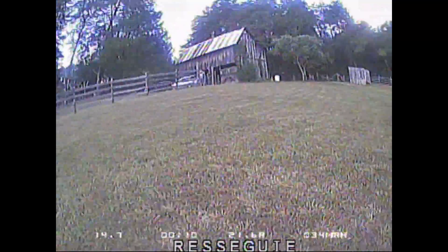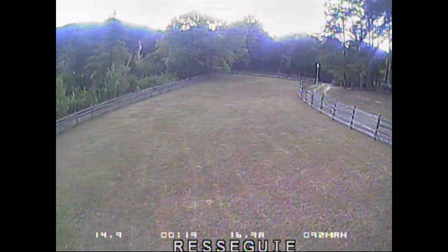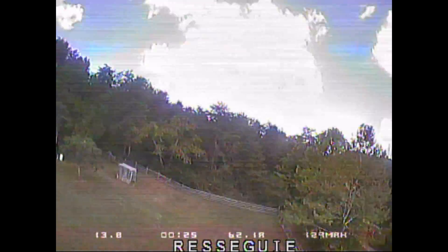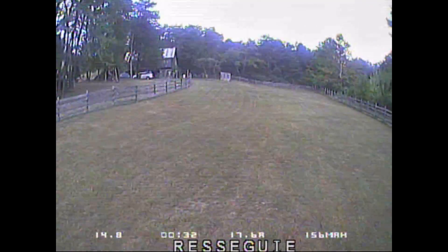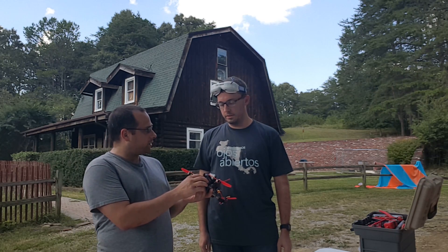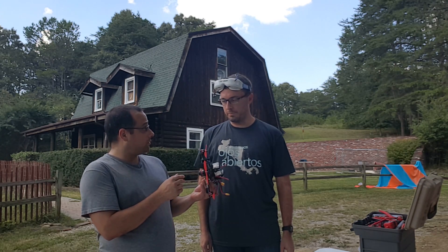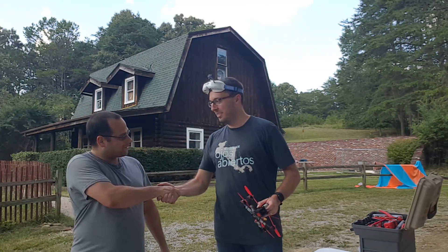There's still a little bit of vibration when David goes to high throttle, so this copter isn't flying perfect yet. But we've made a huge improvement and we've determined why David's PID tuning changes weren't having any effect — it's because the problem wasn't being caused by PIDs, it was being caused by a loose camera board. We had a loose sensor. We still have some high-throttle oscillations, but they're more rhythmic. We're not seeing anything at mid or low throttle, so now we're in the realm of a tuning issue, which will be a subject for another video. Bye everybody — nice working with you.